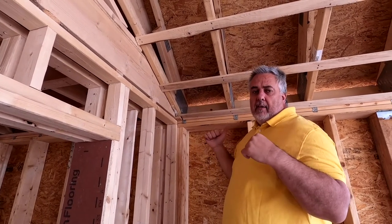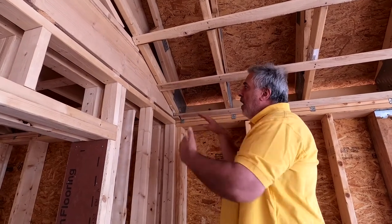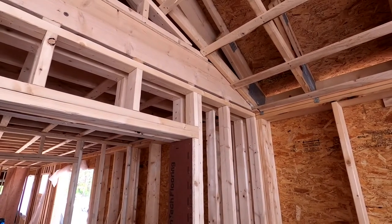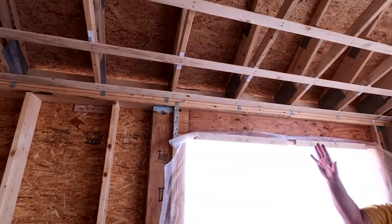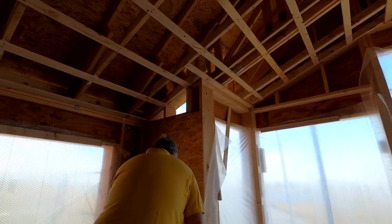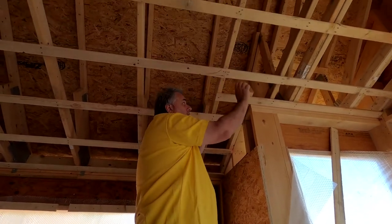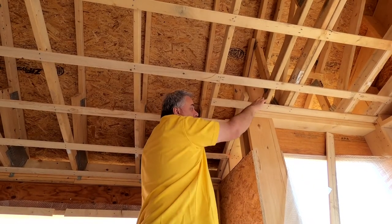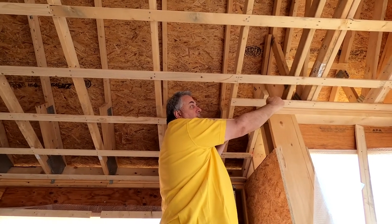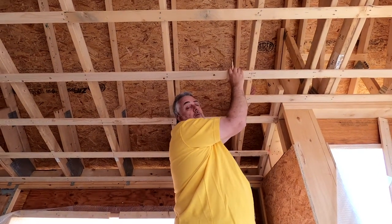We're going to jump back, go to the office, sit down at the desk and talk about that in depth — but I wanted you to see it out here at the job site where these two mix. We carried those roof trusses across the room, and over here you'll notice there's a jog in the wall. That jog necessitates that the last long truss has to get picked up by a smaller truss, so we had to change the wall height and make those trusses plane out on the bottom inside the bedroom volume and also on top with the roof sheeting.